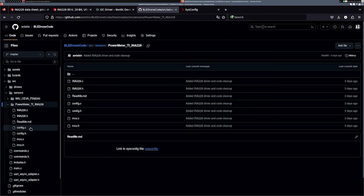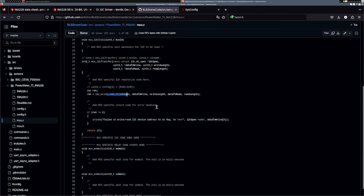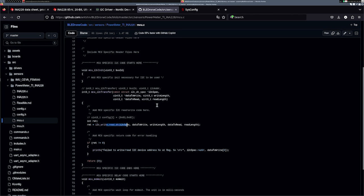You do have to make some modifications to make this work. For example, in the MCU folder, because I'm using the Zephyr RTOS, I had to modify what they had written and enter the Zephyr RTOS APIs. One parameter is to provide the I2C spec, and then from the device tree for this particular I2C you can write. It's not much of a modification — very little modification is required to get this whole system working.